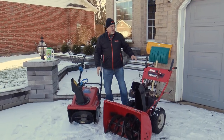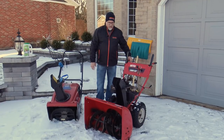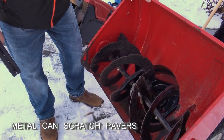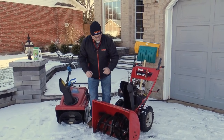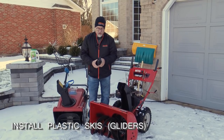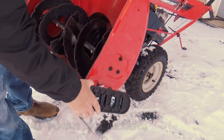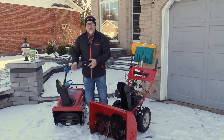The double stage, although it can throw a lot more snow and handle thicker and heavier levels of snow, it has a metal shoe or ski on both sides. This metal ski can run along the pavers and actually scratch them, as well as leave metal particles on the surface. So we recommend, if you have one of these, to pick up at your local mower supply store or hardware store some plastic skis. They're a universal fit — they bolt on one on each side and will allow the snow blower to just glide along nicely on the paving stones.